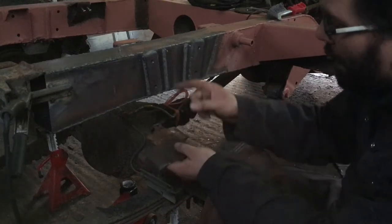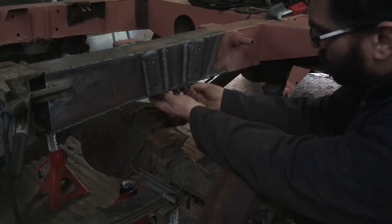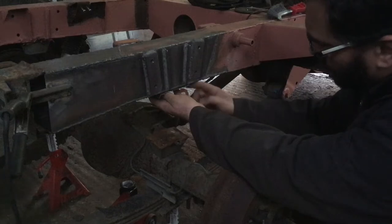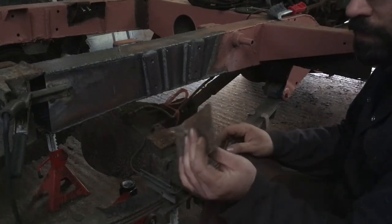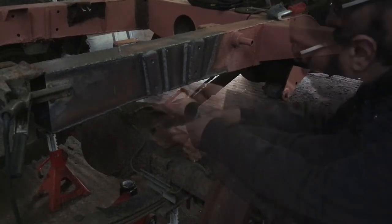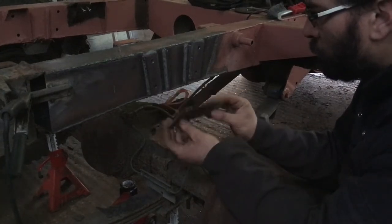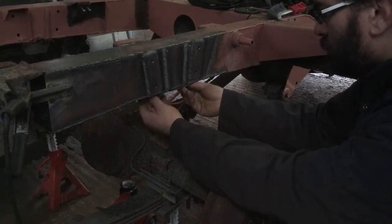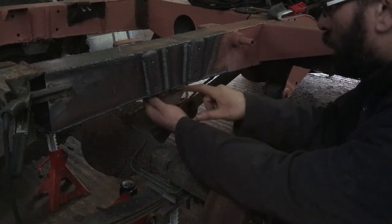But what tends to happen, again, like behind these, especially with this lip, is that mud and stuff and crap gets forced in behind this, and then it rots out the little plate on the bump stop, and it rots out the bottom of your chassis rail. So what I think I'm going to do is make a new one of these again, but I will probably fully seam weld it all the way round. So once that's in, then the bump stop can go back, or at least I can mock the bump stop up and work out where to put the little tab